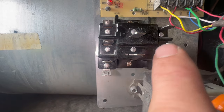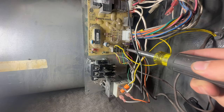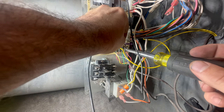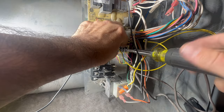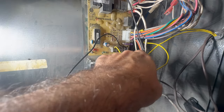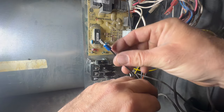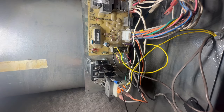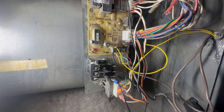Where I'm going to hook up the fan motor main power, I'm going to loosen the common terminal and then feed the wire through the top. Make sure none of the other wires came loose. Run this common to the single side of the coil on the relay.